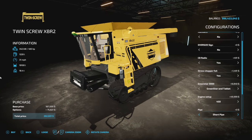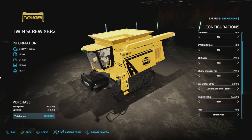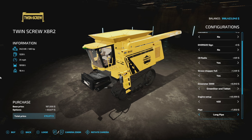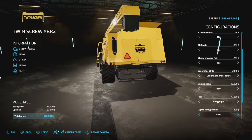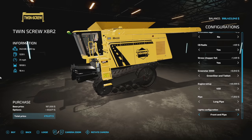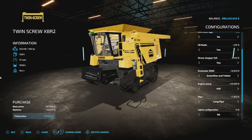The engine options are 306, 356, 412, and 465 horsepower — more than enough for literally whatever you want to do. For the unloading pipe on the back, there's a short and a long option. If you're running around a 10-meter header or smaller, go with the short pipe; anything larger, use the long pipe. For lighting, there are extra lights for the front, back, and pipe, with four or five different stage combinations available.